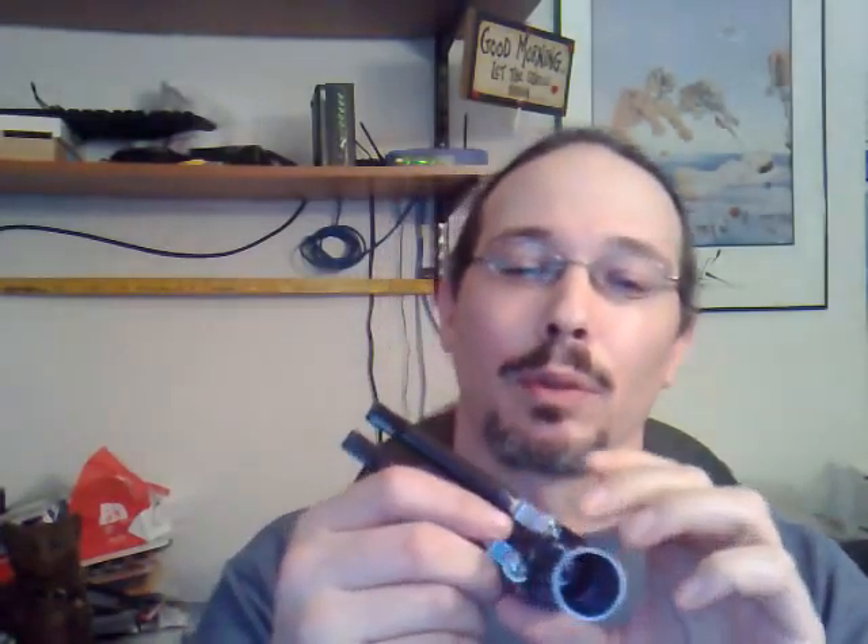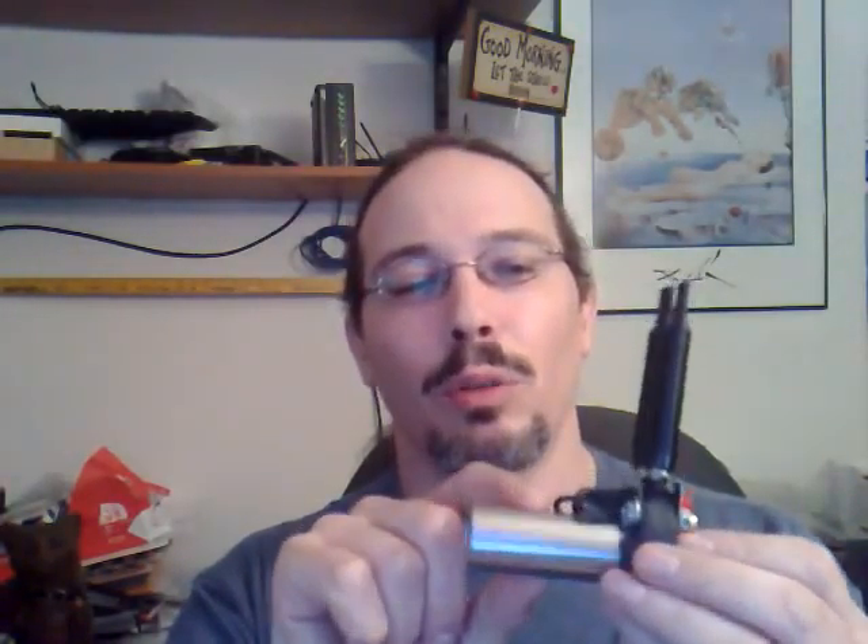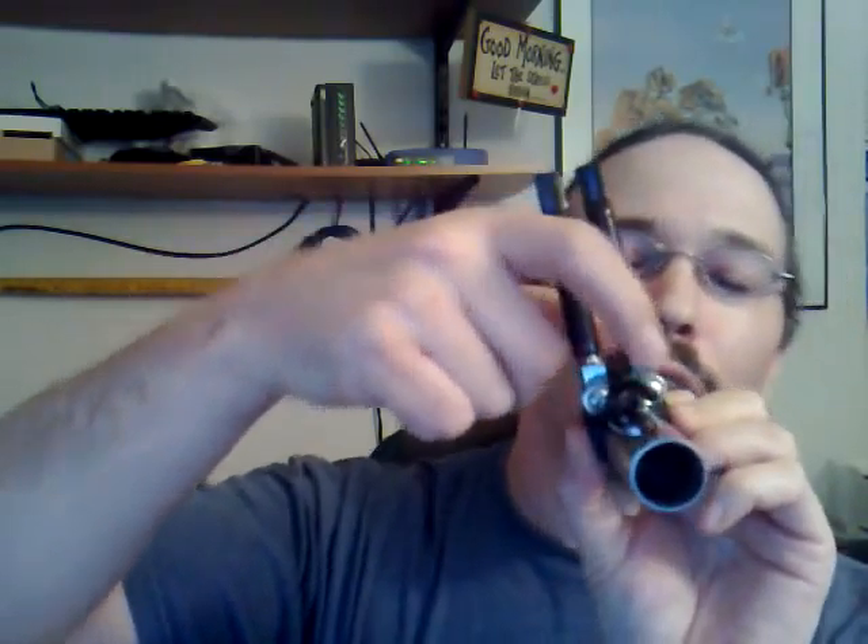When I first got this and looked at it, I originally thought that the negative carried through the body, and that those washers on the screws connecting the atomizer connector were what carried the negative. But when I looked a little bit closer and pulled the wires up, I was able to see — I doubt you're going to see it on the video — but there's actually a hole drilled in the body, and there's a wire inserted so that it makes contact with the body. That wire is then pinned down underneath the two screws that hold the atomizer connections. So it does have a wired connection — it's not just touching.